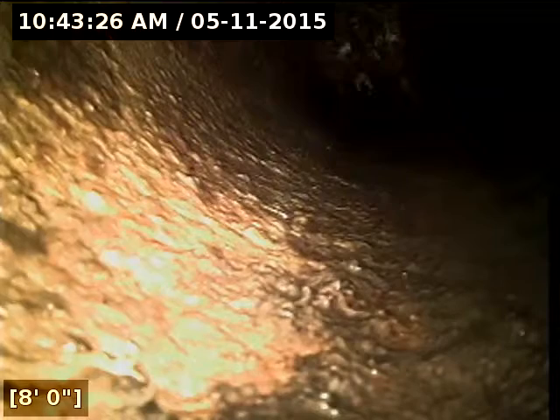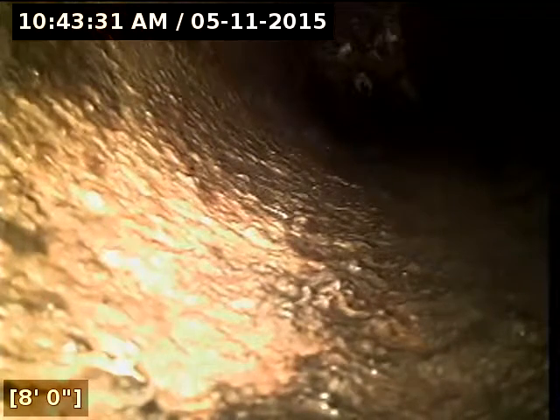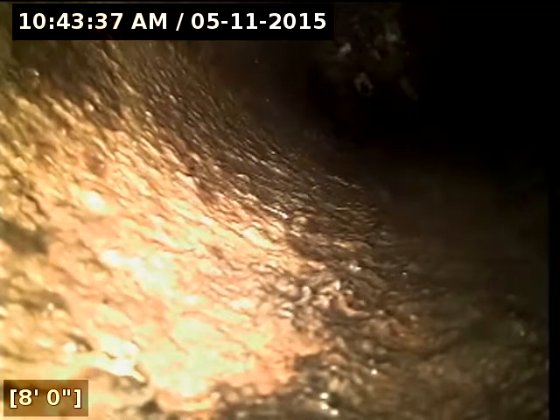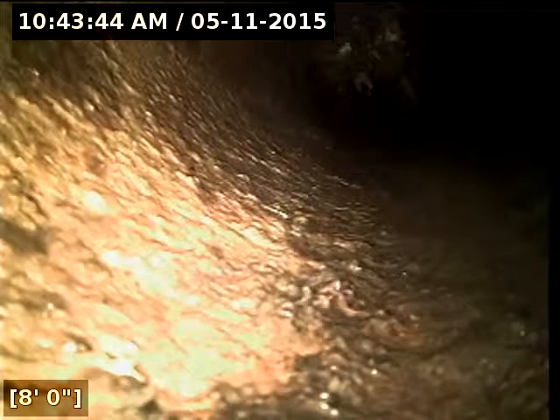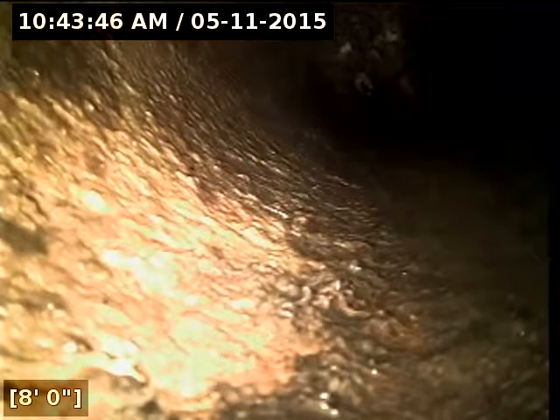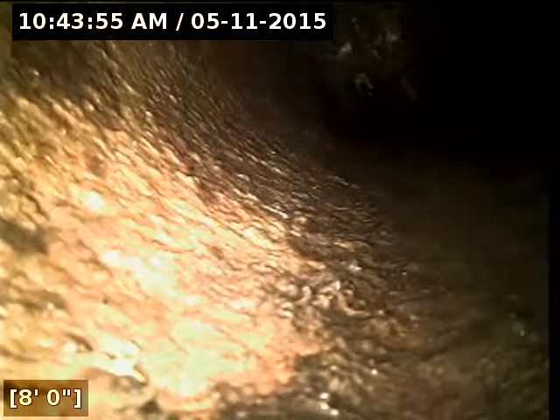The repair is mapped out. I've marked from the cast iron transition here, eight feet from the point of rear access, out to 13 feet — just to replace all the pipe that has root intrusion through it. Beyond 13 feet the sewer line is in great condition, so once this beginning section is taken care of the sewer line is going to be good to go. The repair is on the left side of the home — standing looking at the face of the house, it's about 10 to 12 feet away heading toward the woods, marked with green paint, and right here is also three feet in depth.